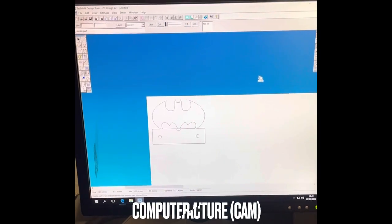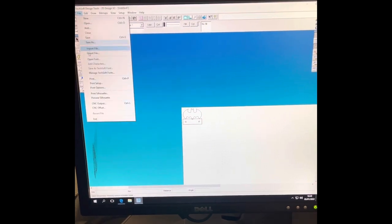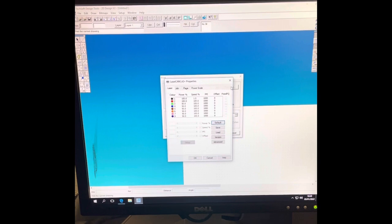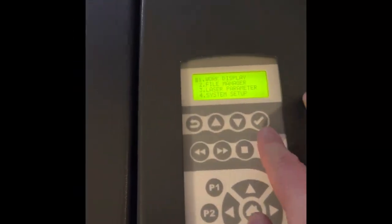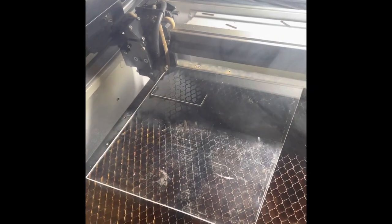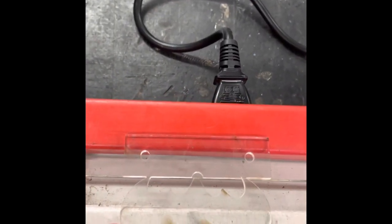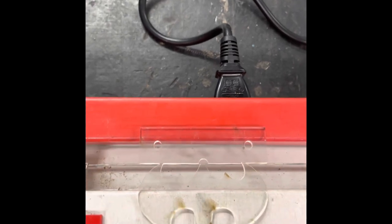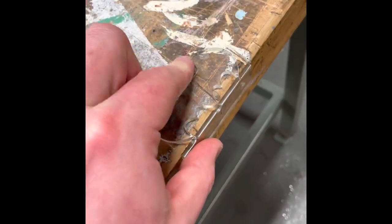Once we've got our image, we can then set it up on the laser cutter — this is an example of CAM, computer aided manufacture. We have to tell the laser cutter the settings to cut out of three mil acrylic, setting up our red and black lines, then press go. You can see the laser cutter cutting through three mil acrylic nice and accurately. Once it's cut out, we use the line bender to bend the bend line we created earlier — that's just above the plaque we're going to screw on. Leave it on the line bender for about a minute and a half until it's warm enough to bend at 90 degrees, then hold that position for about 30 seconds to a minute and it will cool down and set in that 90 degree position.